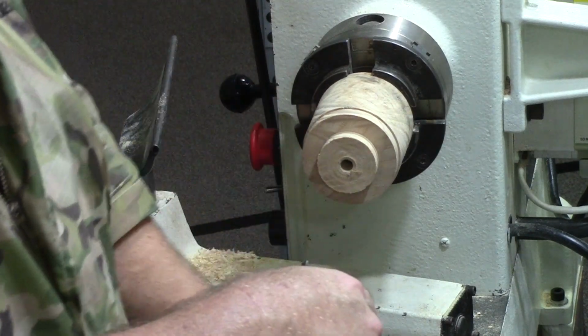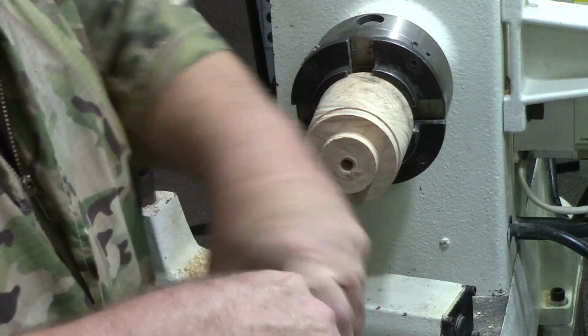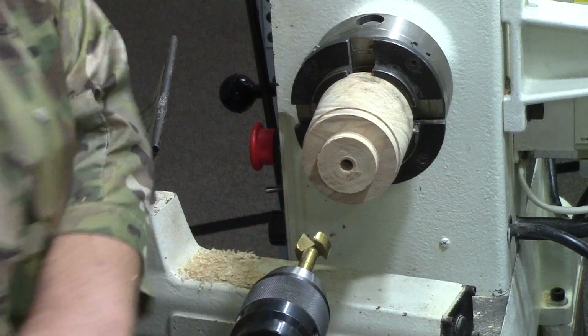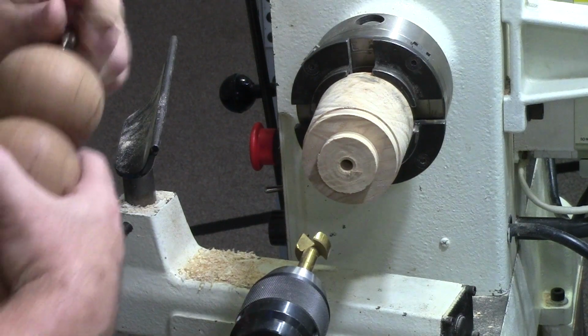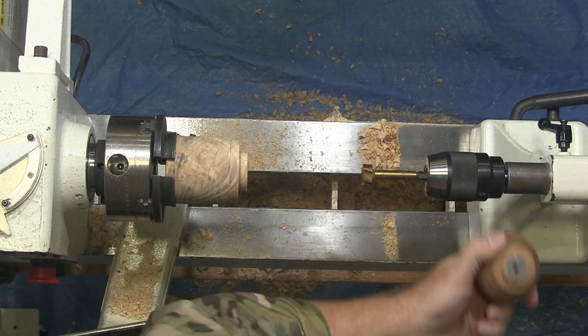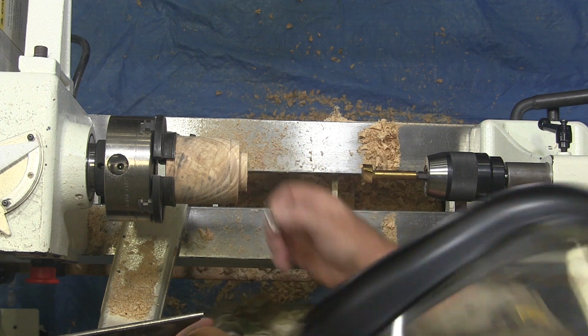That's not the shaft hole. It is the shaft hole, but you'll see here in a minute what I mean. Now, this is a 7/8 Forstner bit. What Nick Cook did was he recessed that plate. The fit and finish is just nicer. Okay? So I'm going to make it so that lays inside something.